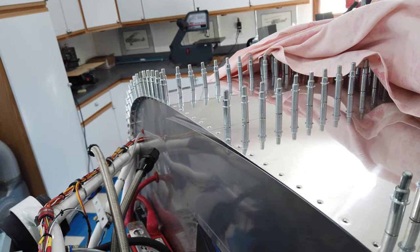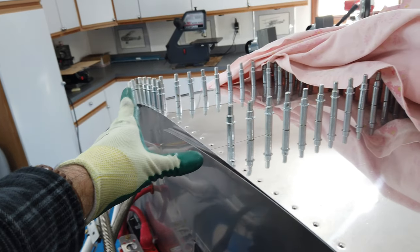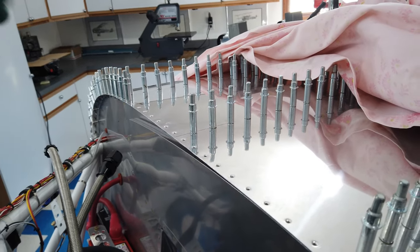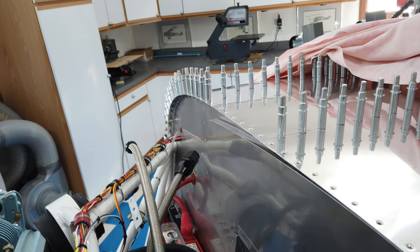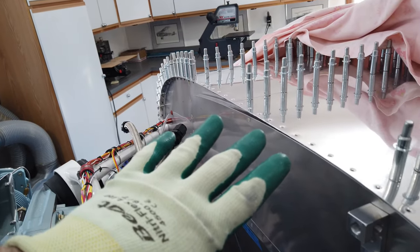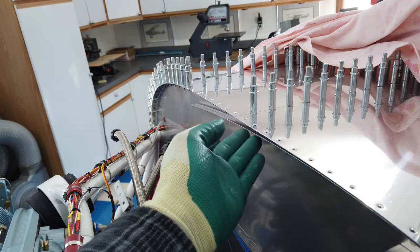The 6.5 inches is just a starting estimate. What's really important is that you're not cutting knuckles in half on your hinge.